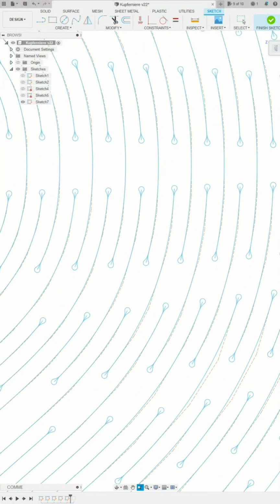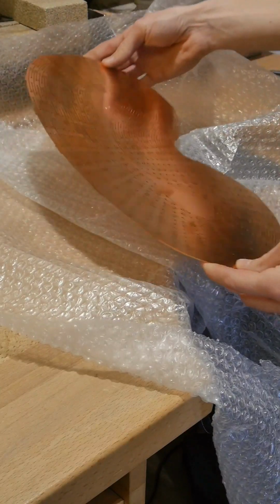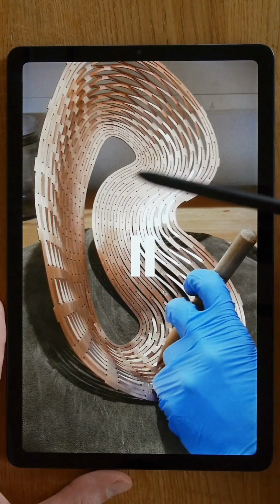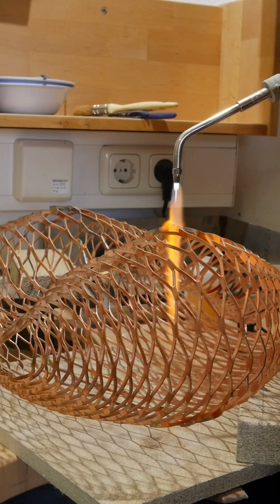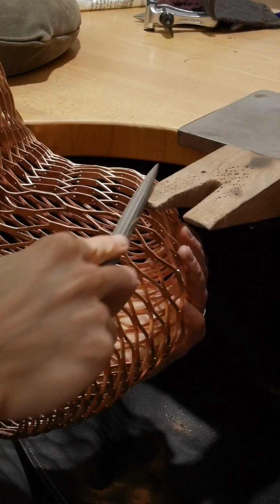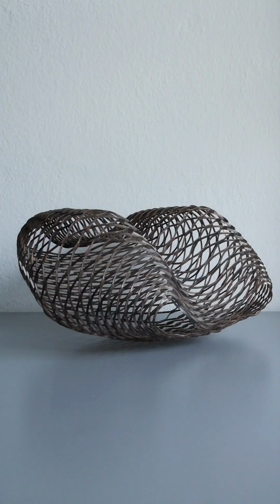The next step was to design a cut pattern and order laser cut copper parts. I designed this prototype quite a bit larger than the silver will be to test out tools and techniques. The little tabs you see on the outer perimeter are there to precisely indicate the solder joints where the two halves will be connected. After soldering, I filed these tabs flush. In most parts happy with this prototype, it was time to finalize the design for the real piece in silver.